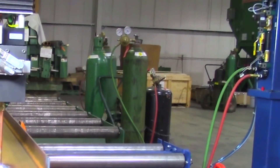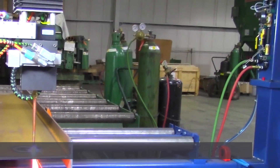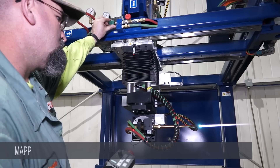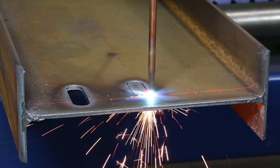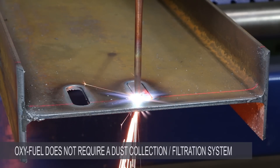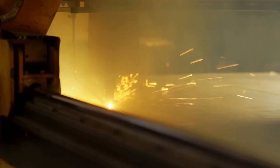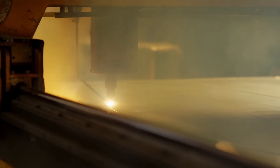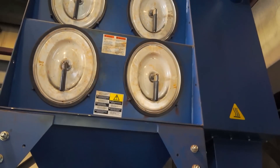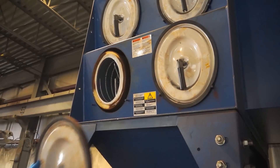The Liberator is an oxyfuel machine, using any available gas including propane, acetylene, chemtane, propylene, MAP, and natural gas. Since it is oxyfuel, this eliminates the need for an expensive dust extraction and filtration system that is mandated with all plasma solutions to remove potent carcinogens which are released by plasma cutting. Dust extraction systems are large, noisy, and expensive to operate and maintain.